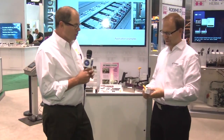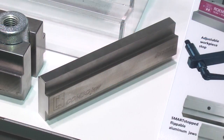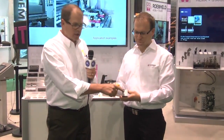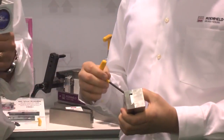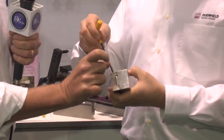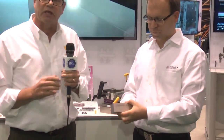Our vice jaws are a simple platform. We use a dovetail assembly that eliminates the need for face-mounted cap screws. A differential screw — which is a right-hand left-hand screw — lifts and pulls the clamp nuts onto the dovetail. That allows our extruded aluminum bar stock to be cut to any length. If you want to use small jaws for small parts or long jaws for long parts, you simply cut the extruded aluminum to whatever length you want.